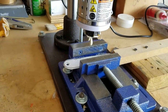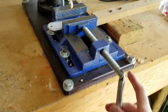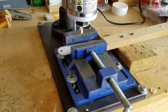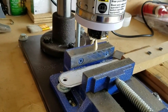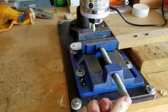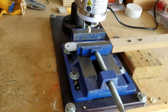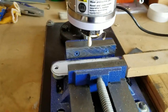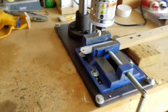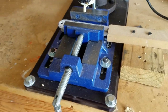It does one shot at a time. You put the mold in — it comes standard with this basic vise. You put your mold in here, then you turn the clamp, clamp it down, pull the handle, do your shot, give it a second, undo it, pull the mold out. Good to go. This system is very simple and it works pretty good.